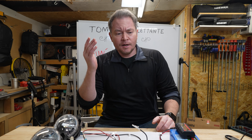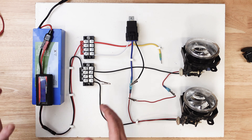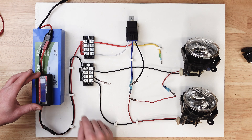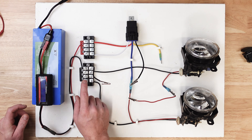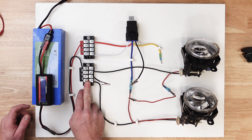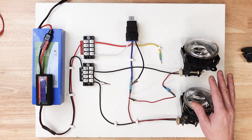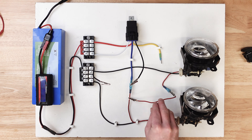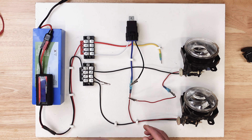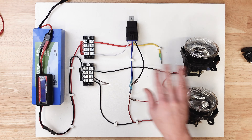Let's actually see this in practice. Here I have a board that I constructed showing a battery power source, a couple of lights, and a relay. My 12-volt power source goes through a wattmeter and power analyzer, leading to a power distribution block and a ground distribution block — think of these like the positive and negative terminals on your car's battery. The lights I'm using are a couple of old fog lights from my Subaru, wired for power to the blue wire and ground directly to the grounding distribution block. Normally I could just turn on these lights by connecting to the battery, but instead I have it interrupted by a relay.